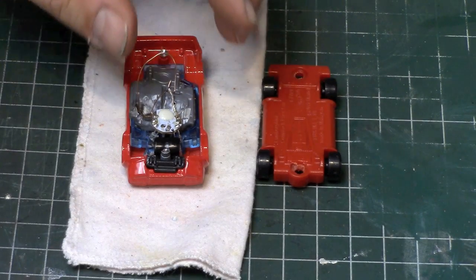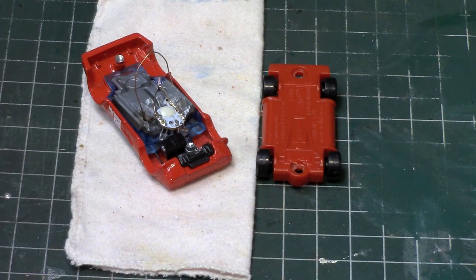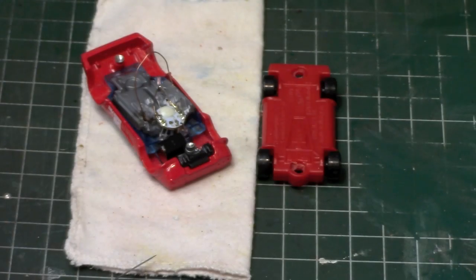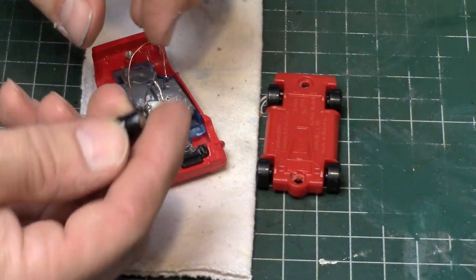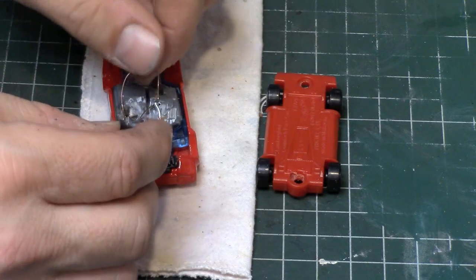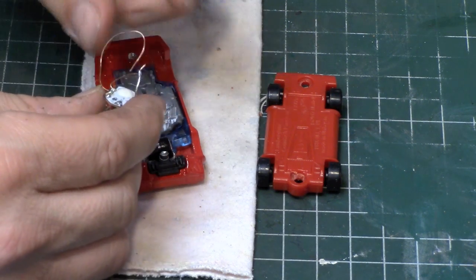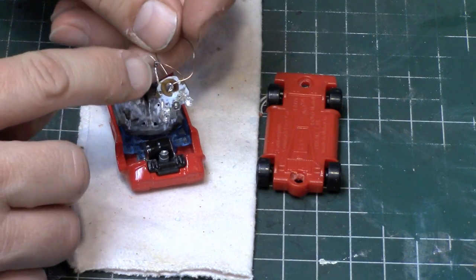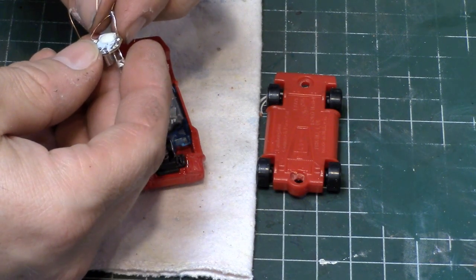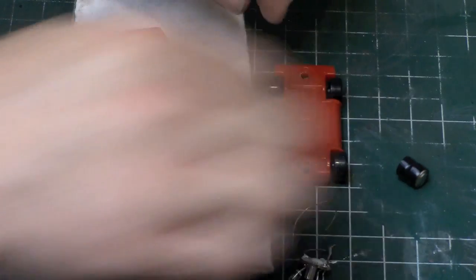After getting this figured out — the super glue didn't work — I ended up taking two fatter batteries, 754s, out of a pack from Harbor Freight I had laying around. I cut a piece of electrical tape in half and put the two batteries together; they have to be stacked. I soldered tails on: one side is the negative of the LEDs and the two tied together are the positive. I finally got it to work, so we'll move on to detailing.